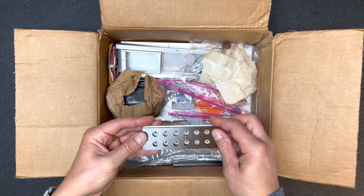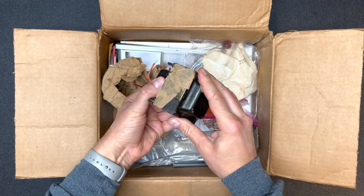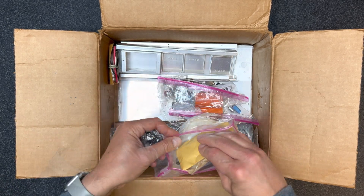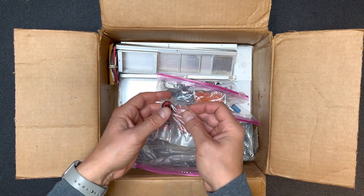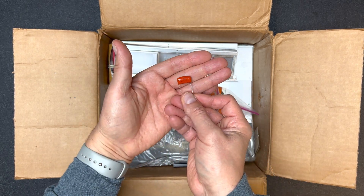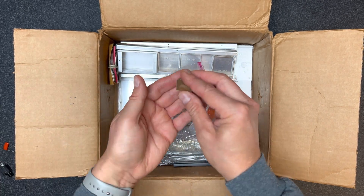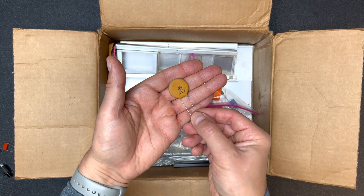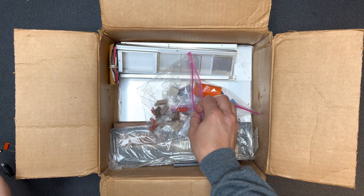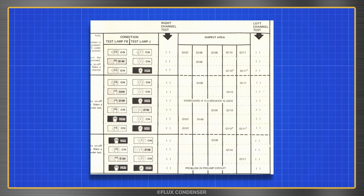The insulator for the jacks — they'll fit together something like this. Here's the power transformer. Looks like there's no rust, so that's good news. Just a bit of stuck paper, but that should clean right up. And for today's healthy snack we have a fuse holder. A bunch of bags with some lugs and nuts, and more knobs for the push buttons. A choke. More hardware. Another choke. A 5-watt resistor. Speaker connector strip. An orange drop style capacitor. Headphone jack — this is the unswitched kind, so there's going to be a front panel control to turn the speakers off when listening to headphones. A rubber foot. A bulb and socket. A fuse. And with Heathkit, these bulbs may not be for display purposes, but instead actually for testing the amp once it's built — they work kind of like a poor man's multimeter. I'll explain more about that when the time comes.